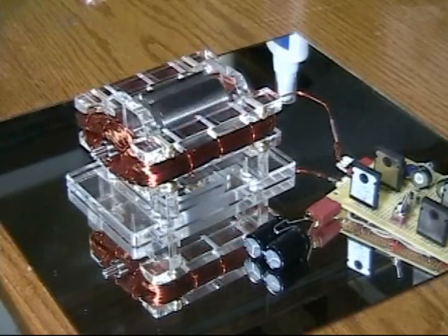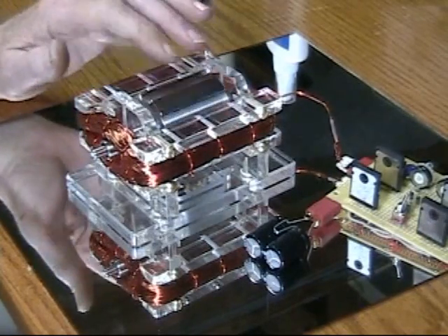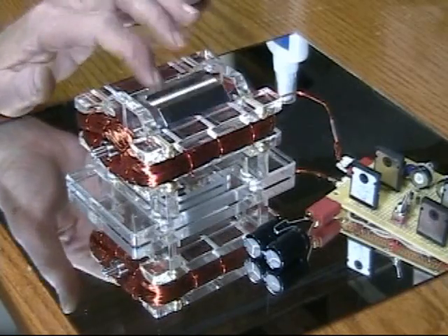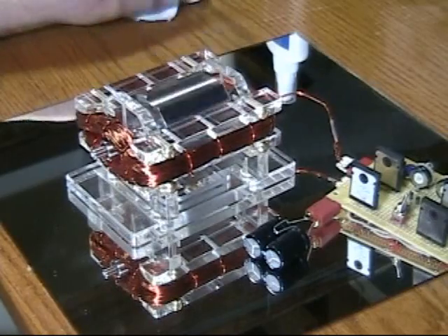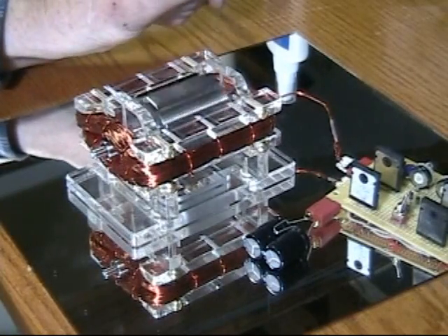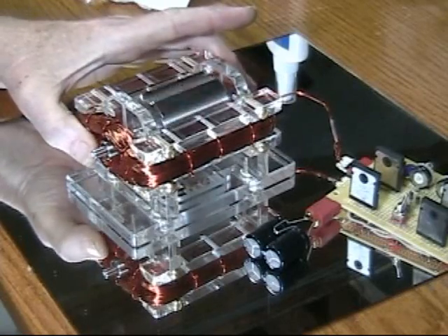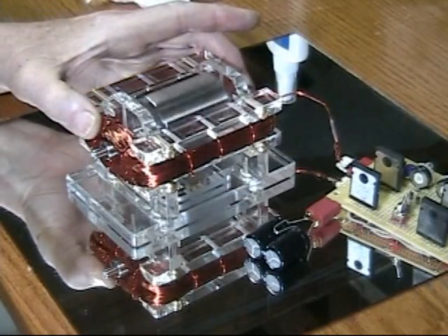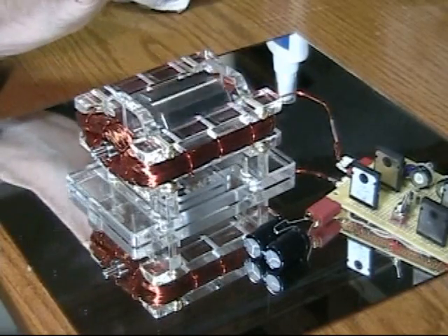It should run a while on that while we look at the motor. As you can see, I have six magnets — per usual for my build. The coil is about 400 turns, about 400 foot of tri-filer. Two trigger coils so that we trigger off of both sides of the circuit.